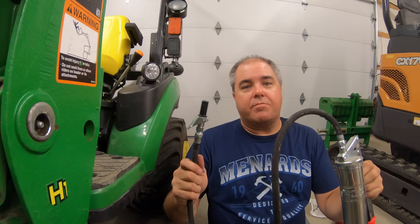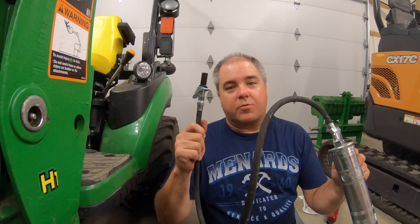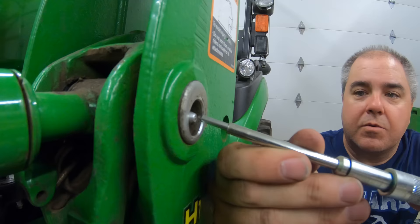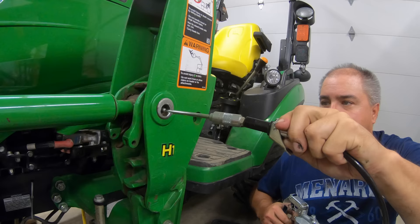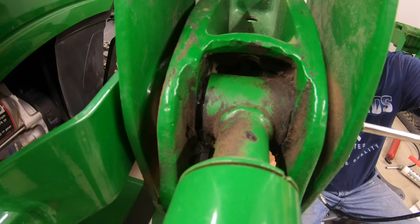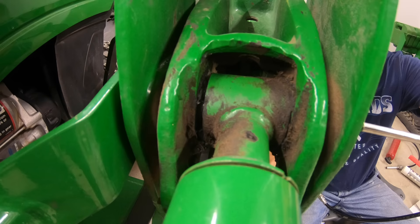My brother's been telling me for years to get a one-meter hose — it'll be a lot easier to handle because you can get your gun out of the way. You don't have to worry about where it is compared to where you're greasing. So what we're going to do is take this needle nozzle and push it right in the ball of the grease fitting, and I'm able to inject the grease right into the ball. A little bit slid out — you're seeing the grease come out. One more pump — yeah, we saw it grow.